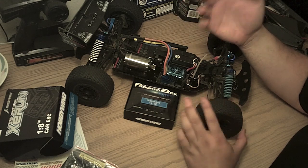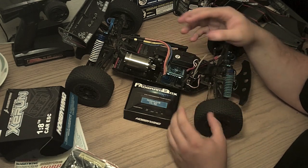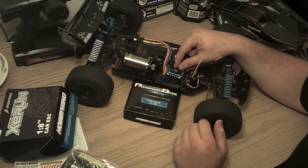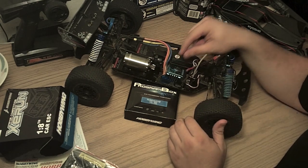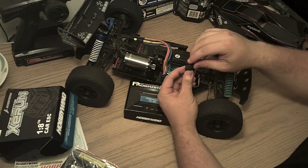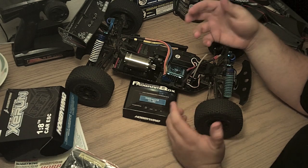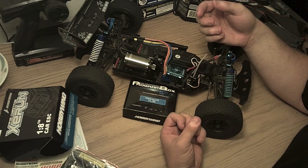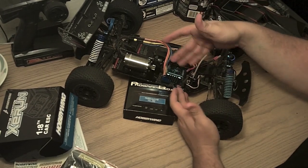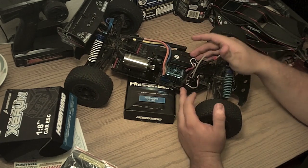The Mamba Max was really being pushed to the edge, and this speed controller is not even breaking a sweat. That cogging I was talking about earlier — none with this controller. Once you let it spin a little bit, it's absolutely smooth. I bet with a sensored motor, this thing would be an excellent crawling speed controller. The only downside is really the physical size — it's a little bigger than a Mamba Max in width and length. It has quite a bit of height, but that's mostly due to the fan under the heat sink, which cools it really well and pushes a lot of air.